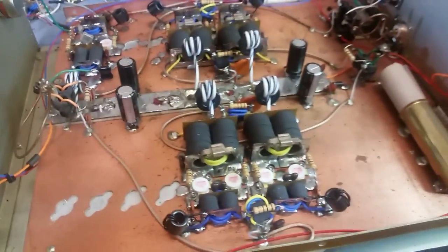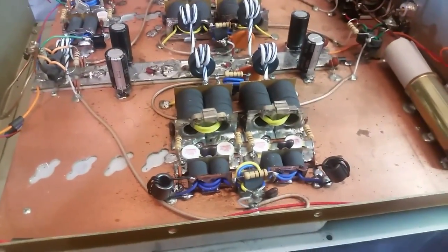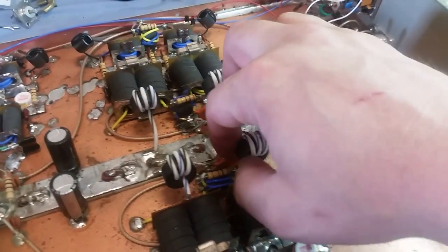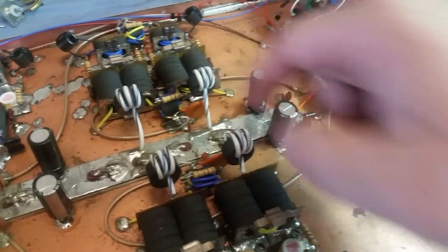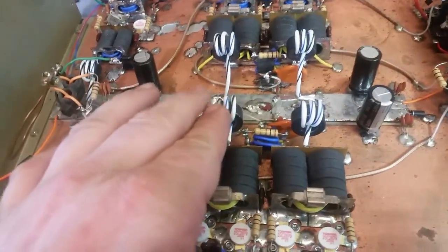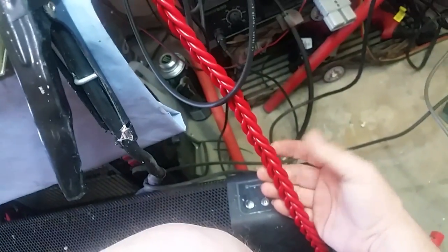I shine that bad boy up for you. I clean the whole board as best as I possibly could clean it. You got your all new non-dot 2879 Toshibas installed now. And I think I already mentioned that I took the output loading capacitors / tuning capacitors off, put two matched 150s on there. $5 caps from Tone from Fat Boy ICA. And of course, I think I've already told you about, basically there was no ferrite on the power wires at all. Take a look at that GK braiding job on the power wires.